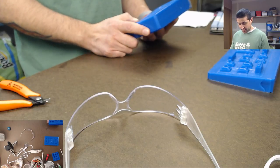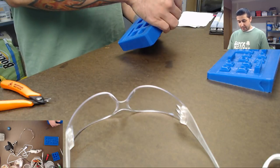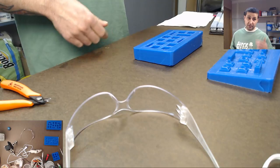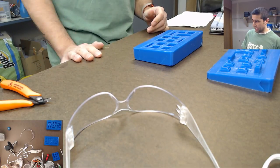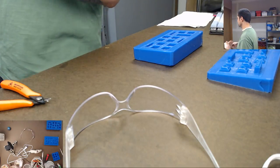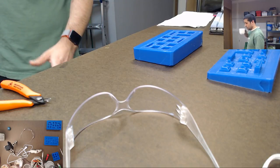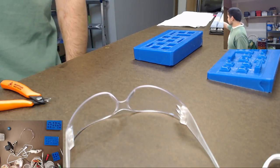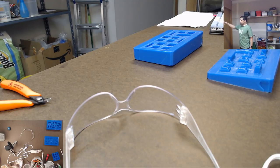And then I decided that I wanted to do a couple other things with it, so I ended up doing the other half of it on another stream, and then the one that I made the other day still needs to cure a little more, but this has been curing for like 4 days, so I think we're good. We can do casting on it, because you gotta let them cure, kind of just let them sit and leach out the alcohols and chemicals they use to make the silicone plastic or liquid. So that's all worked out now, hopefully. Now we can actually make some resin.